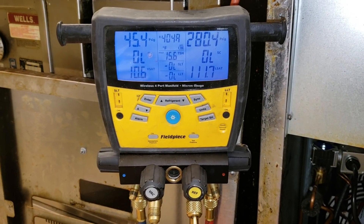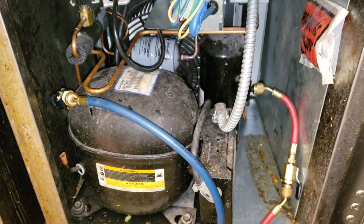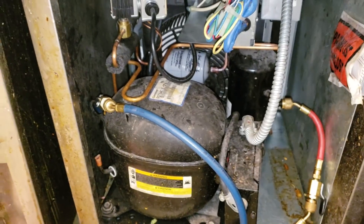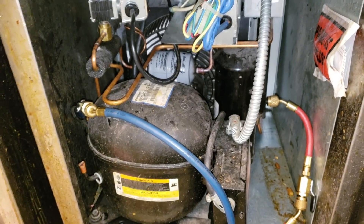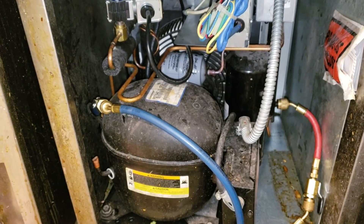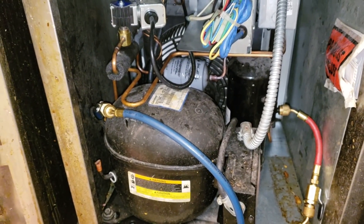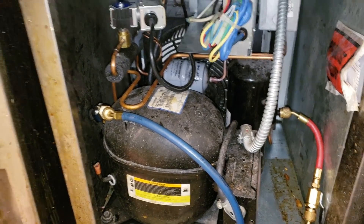25 to 30 degrees for our vapor saturation temperature is pretty typical, and 25 to 30 degrees above ambient is pretty typical on a reach-in cooler because they run higher box TDs on these things. The unit is pulling down so it's under a heavy load - take it with a grain of salt. But I weighed in the charge so I know my charge is correct. The manufacturer isn't going to tell you that you should have 30 degrees above ambient and 25 degrees below box temp - it's just things you have to pay attention to as you work on this equipment more and more. Pulling the charge out and weighing it back in is the only way to do it right.